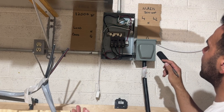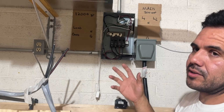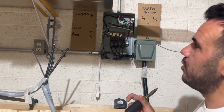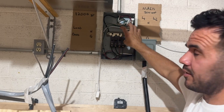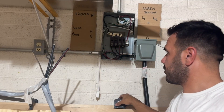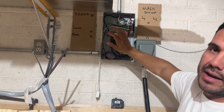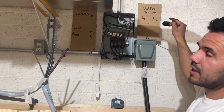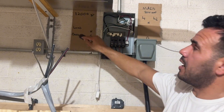The benefit of doing what I did is that if it's dark, raining, or there's not enough solar and your batteries get low, your lights aren't going to turn off — because you have that grid input and that 100-amp breaker tied into the main panel. Using my 12,000 XP settings as an example: if the batteries get below 20% and there's not enough solar to cover my energy consumption in the critical loads panel, it'll just stop trying to use solar and batteries and start buying electricity from the grid. That's where those four wires hooked up to the main service panel come into play. Once the sun comes out and batteries charge back up, it automatically stops buying from the utility company. There are settings inside the 12,000 XP so that once your batteries get above 50%, you automatically go back to using solar and batteries.